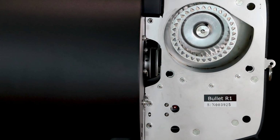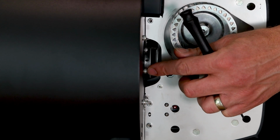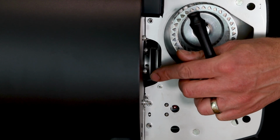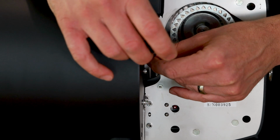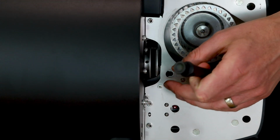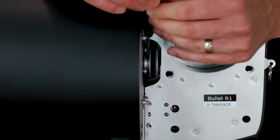This is actually the part where the power of the motor is being translated to the roast drum. You can turn this if you open the roaster on the front and then very carefully turn the roast chamber until you reach these holes. You take the H2 tool, go into the hole and then check if the screws are tightened. Here it is. It's actually 2 screws. The second one is here.